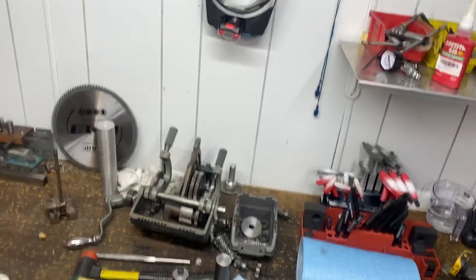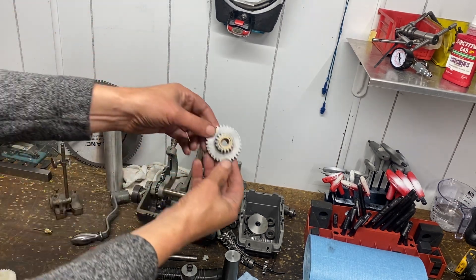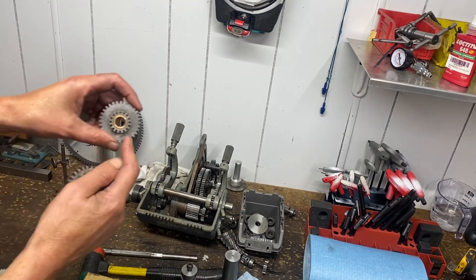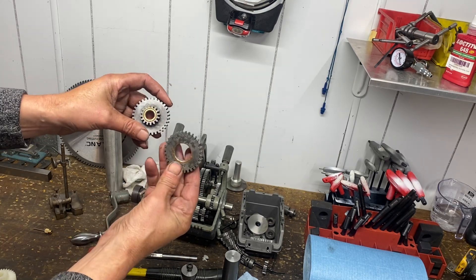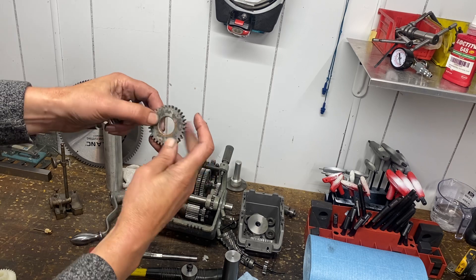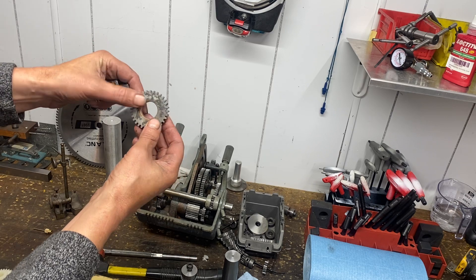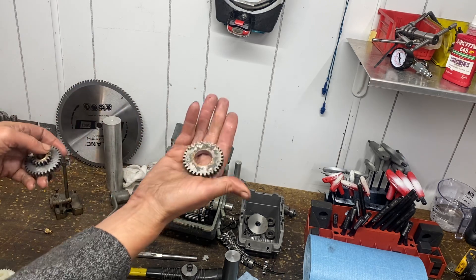I like it a lot but I'm thinking I might switch to the 12-inch one instead and sell this one off. Not sure yet, but either way this needs to be repaired. The previous owner crashed this at some point and ruined some of the gears in the gearbox, so I am going through and making some repairs. The inner cog is 16 tooth and it was heavily damaged, so I just removed it. The outer cog had some very minor damage and I ran the cutter through and straightened a couple of teeth out — it's 100% serviceable so I'm going to reuse it.